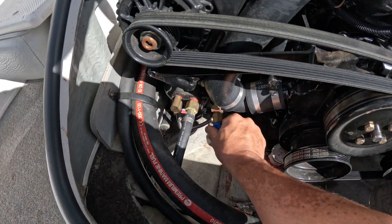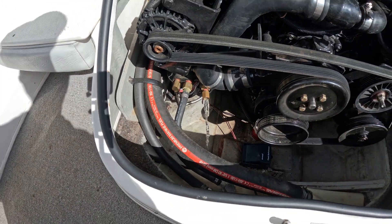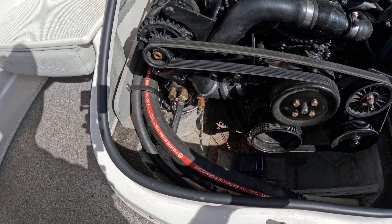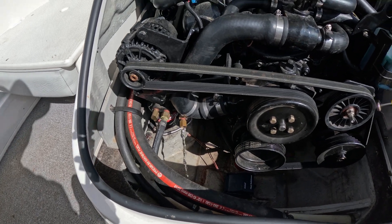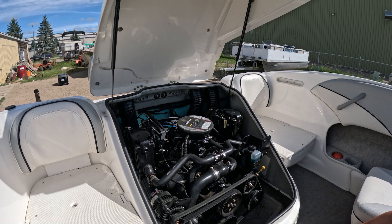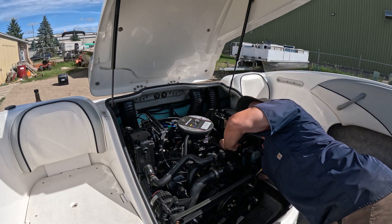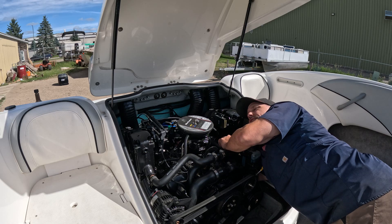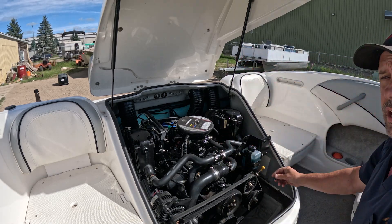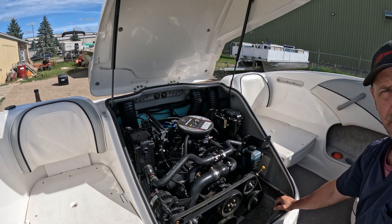We'll start with this bottom one here. We want water to come out of all of these. If water isn't coming out of all of these, there's an issue and what we need to do is probe inside with a screwdriver or a hard plastic item to dislodge anything that might be inside that hole. Noting that we have decent water flow from there, I'm going to pull the plugs out on the port side. I'm going to reach in and grab that bottom one on the block first, spinning it out, and leave my hand in there to feel the pressure of the water coming out and confirm sufficient water flow. The reason I went with the block first is if I go with the manifold I'm going to dump water all over my arm.